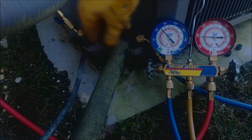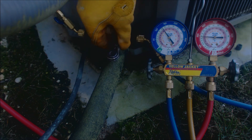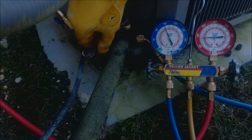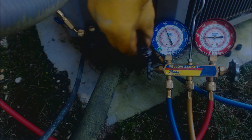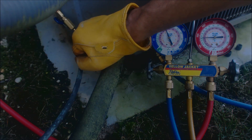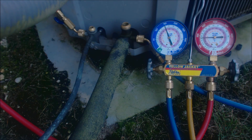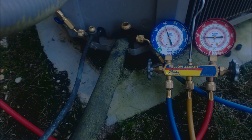That compressor is definitely not strong enough, so we're just going to shut this down. The compressor's internal relief valve actually opened up — you may have heard that noise. So the compressor is not strong enough, and that's actually why we're changing this unit out. We're going to pull the disconnect now. We're left having to recover the refrigerant out of this unit. The pressure relief valve inside the compressor opened, and the high side pressure actually went back down into the low side.